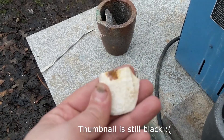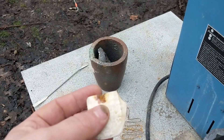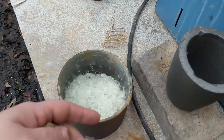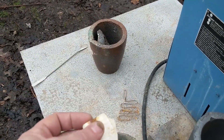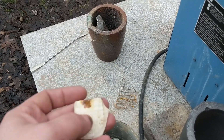You have the anode that I was growing from. You'll notice there's some iron all over it which came from the clip that I was using. I'm hoping the iron impurities in my silver nitrate will get fluxed out because it's going to get hot enough in this kiln to melt the silver but not the iron.